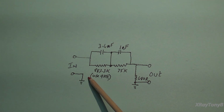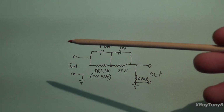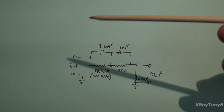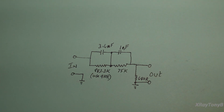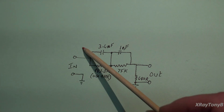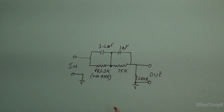And second of all, there are 2 different types of phono impedance and phono gains. One being for a moving magnet cartridge and one being for a moving coil cartridge. They both have different impedances and they both have different voltage outputs. So you need to put a little bit of extra attenuation circuitry in the front here to compensate for that, which is still not that complicated.